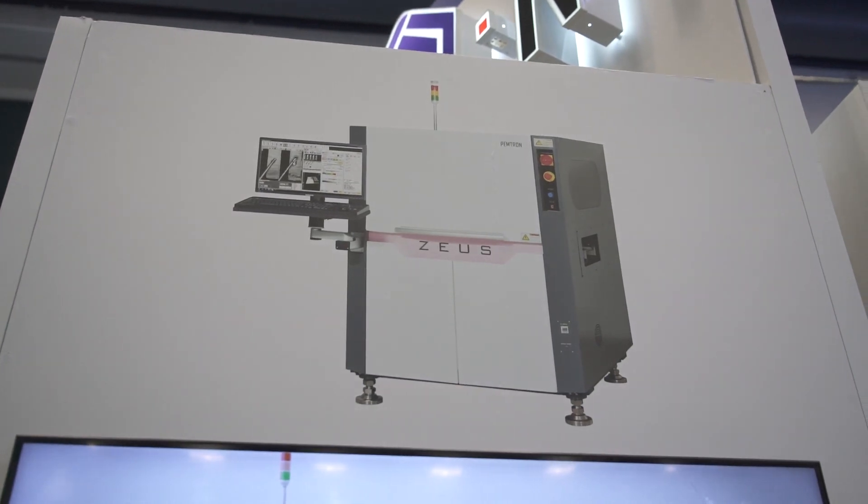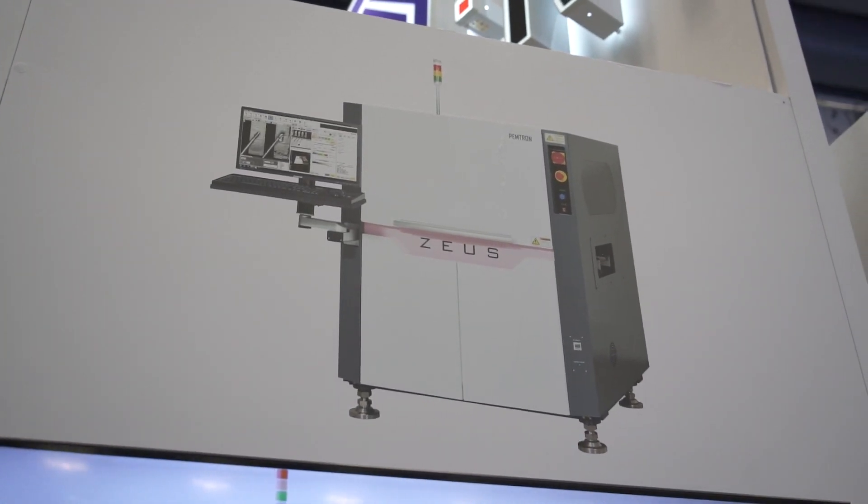You have a huge suite of different inspection tools here in the semiconductor side of the business. So let's take a quick walk through some of these. Starting with the material handler around the corner there — that's the model called the GEOS system. The basic platform is from our AOI in-line system, but we add more advanced technology to inspect the wire bonding and die attach with 3D technology. There are a lot of 2D inspection systems for wire bonding, but we came up with a very stable and powerful 3D AOI for the wire bonding process.